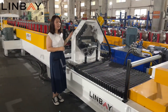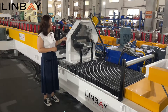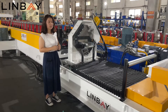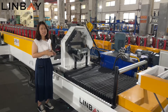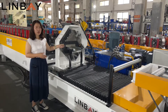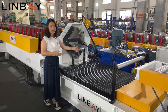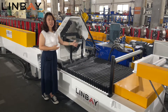It is very economical. The last part of the roll forming machine is the cut — a hydraulic flying cut. It will not stop the roll forming machine rollers when cutting to length. You can cut any length you want, such as 1000 millimeters or up to 6000 millimeters. This cut system produces no wastage when starting production, saving steel material and reducing production costs.